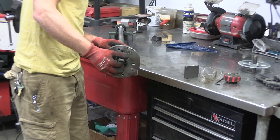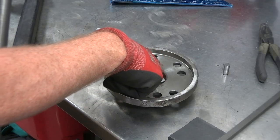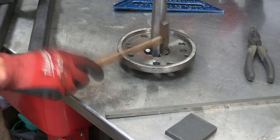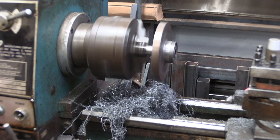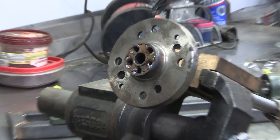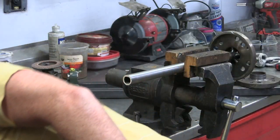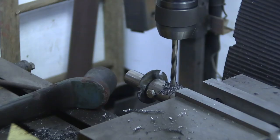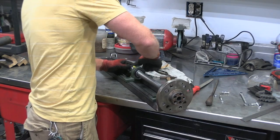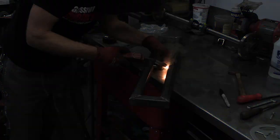Now it's time to mount the hubs on the end of the axle — unfortunately my shaft didn't have enough girth. To fix that I cut several spacers and placed them inside the hub. I checked it for wobble on the lathe and then welded it up with a lot of filler material. Next I cut the axle in half because I want that adapter and sprocket to go in the middle. Too bad the sprocket doesn't actually fit there and I'm going to need to cut space in order for it to exist.